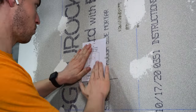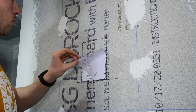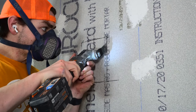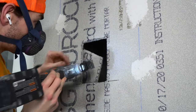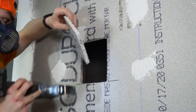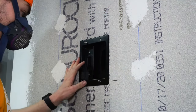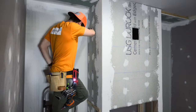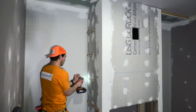Next up is installing the TV back box. The recessed outlet kit came with a template that made it easy. I drilled through the backside to the front to make sure I'd line up with the blocking, then drilled out the corners and cut it with my oscillating multi-tool — done. Once cut out, I installed the recessed box and traced it so I could run tile right up to the line and have a perfect recess later. I also tried to pre-install floating shelf brackets to tile around, but that didn't work out because I couldn't cut the tile that thin.